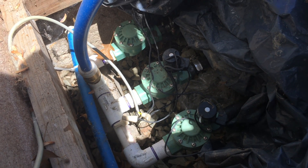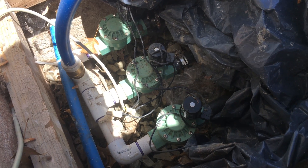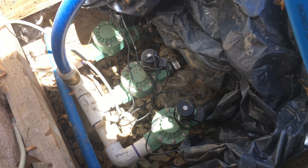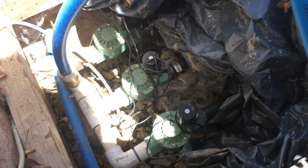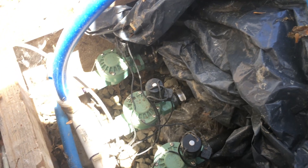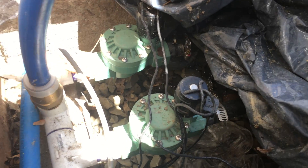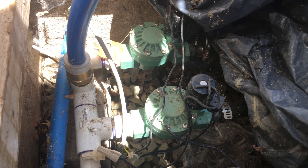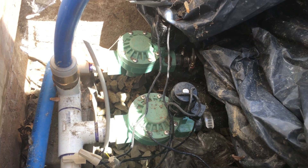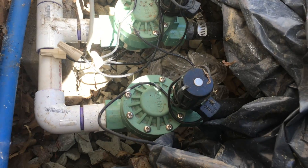Before we get to installing let's talk about the actual sprinkler valves for a second. The valves I am using are Orbit sprinkler valves — the link to them is also on my website. These valves have two leads that come out of them and they require at least 24 volts to trigger them and let water through. Also, these valves are AC which means it does not matter the direction of the current.